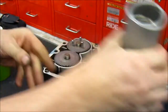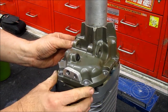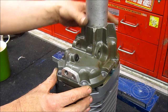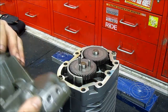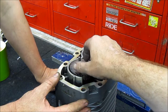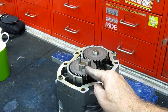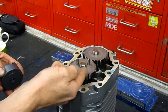In our wisdom, we thought we'd turn it round so we can come off the left-hand side. But voilà - the cover doesn't fit. It's not symmetrical. I thought I'd get round that - we can re-drill it. Wrong. They've even altered every bolt hole; it's completely out. The reason why that's important is because these pegs here are the drive pegs to spin this thing up from the drive shaft. And when you spin it round like we have, if we drive it from that lower one, it'll actually spin the wrong way round.